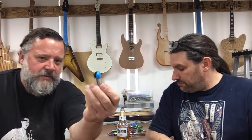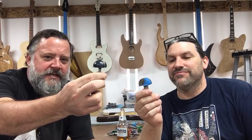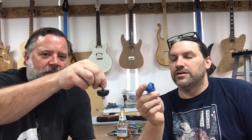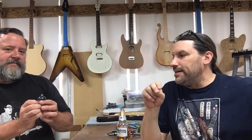What do you call this? A cove bit. This is a cove bit with a bearing on it, similar to other cove bits. We use this when we do German carve Mosrite bodies — it just starts that cove around the body, scoops it out, and you can leave it or continue to German carve the rest. Some guys making Mosrite-style guitars just put that cove in and call it a German carve — but no, it's just a cove. A half-inch cove is the easiest part of a German carve to do; the rest of it's hard.